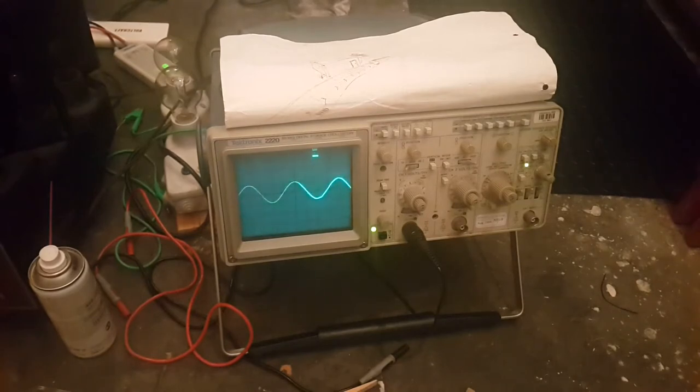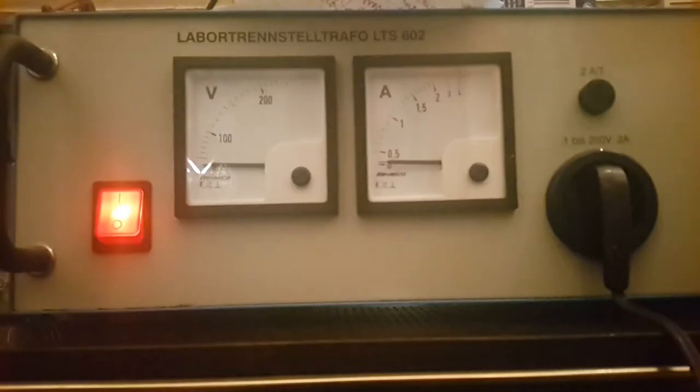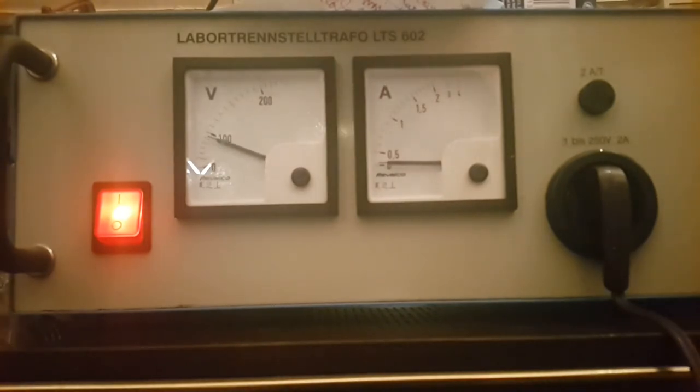Turning the TV on, but I'm not giving it any voltage yet. Whoa. Okay, yeah. I wonder if this tube being gone means that none of the tubes are lighting up because the filaments are in series. We'll have to figure out another way. Tube is back in there. Let's see what happens. Nothing, because the TV is off.